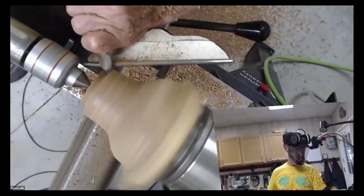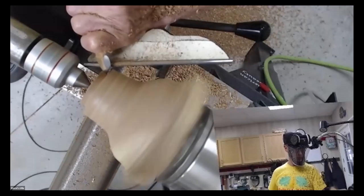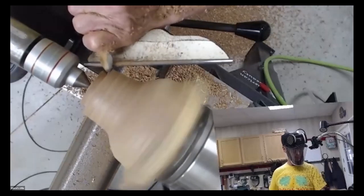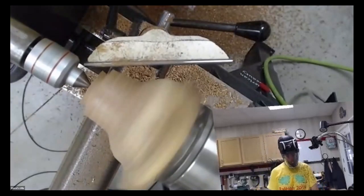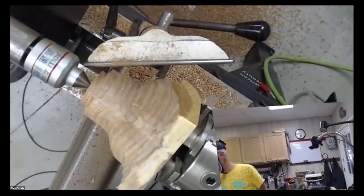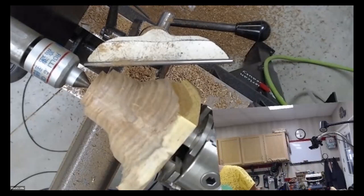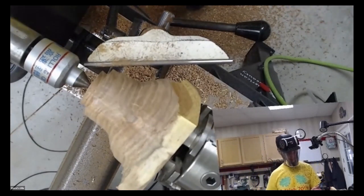My favorite wood is mesquite, if I could get hold of it. But I'm cheap. I don't want to pay money for it, and that's hard to do. Mesquite is easy to turn and easy to finish. One of the problems with mesquite is that oftentimes there's ring check, so you have to have a real large tree to get something worthy out of it.